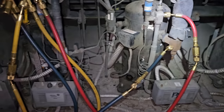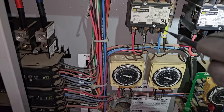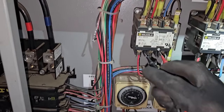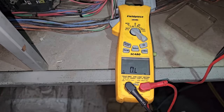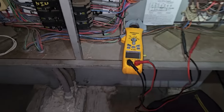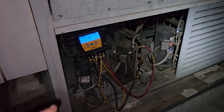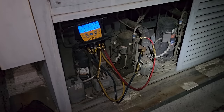I'm going to cool the compressor off. I'll test it at the compressor contactor because the connections are kind of jacked up in there, so we can test it over at the contactor and see if we're open on thermal. I already tested to make sure voltage is dead — it is dead. So now we're going to go across the bottom of the contactor and we're open. All three windings are open. We're going to try to get this guy to reset. We're hoping the thermal overload is off — maybe it's low on gas. I'm going to get a water hose so we can run water over the head of the compressor and try to get it to reset.